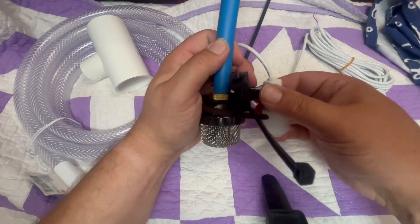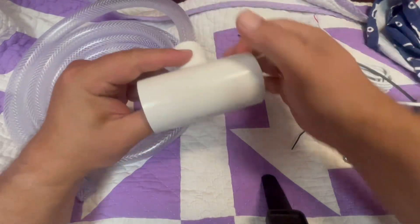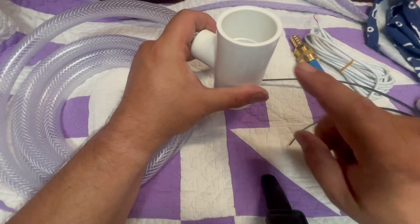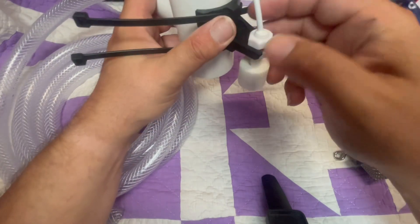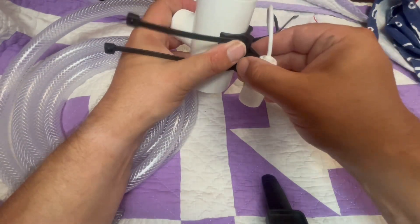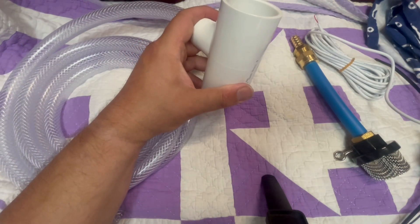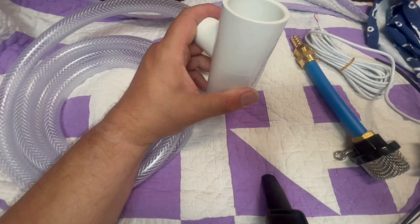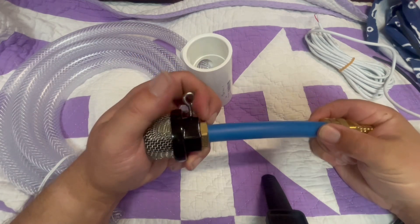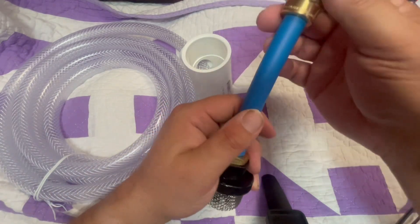For the high limit we're going to run the hose through a T with a 90-degree attachment. This will be at the bulkhead where the water comes out, and the high limit can be mounted using zip ties directly to this 90-degree fitting. This is just a resting point for mounting the high level switch. We want to make sure that alarm goes off as we're getting close to the bulkhead so that we're not getting water intrusion into the main bilge from the gray water for the shower. Since this unit is designed to be disassembled for cleaning, we are not going to be crimping any of these connections — they'll just sit together so that as the pump runs the suction will help keep it together.